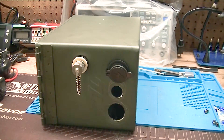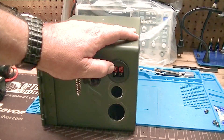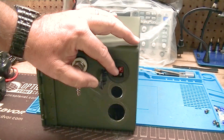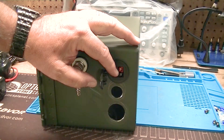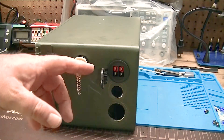I don't have a really great meter setup for this can because of the size and there's not a lot of places to mount things. I decided to go with a different plan on how to put a meter in it. The wiring is a little different — one set of connectors will be on all the time, and the other connector will be switched based on the power switch. The bottom set will probably be hot all the time, and I can use that to plug in my solar panel to recharge the battery. Both of my solar panels have a charge controller with them, so I don't need to put a separate charge controller in this device.